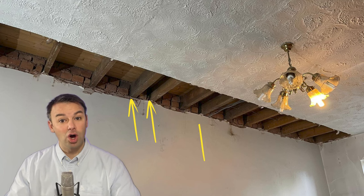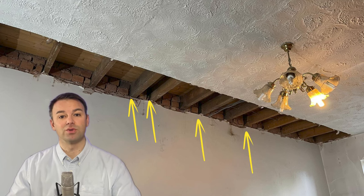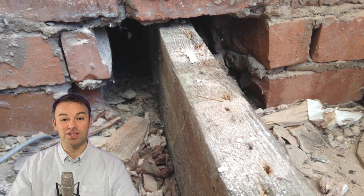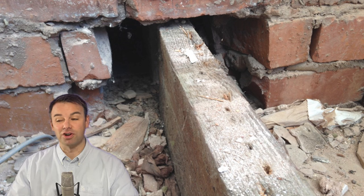The first thing we're going to do is cut open the ceiling, and it reveals holes in the structure. We kind of knew there were holes in the structure because of the high frequency the homeowner was hearing from the neighbours. If you're hearing clear conversation or a TV presenter's voice, that's high frequency coming through — and high frequency struggles to come through bricks and mortar, so that gives you an inkling that you have holes in the structure.